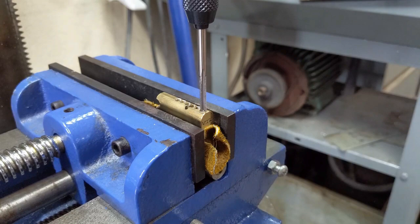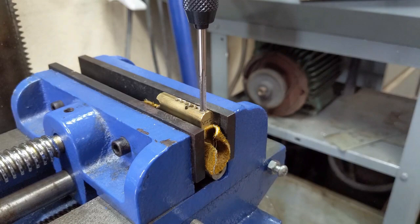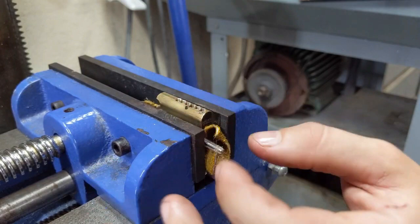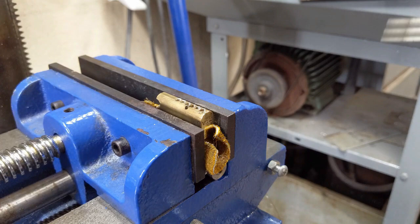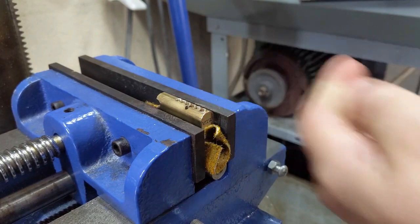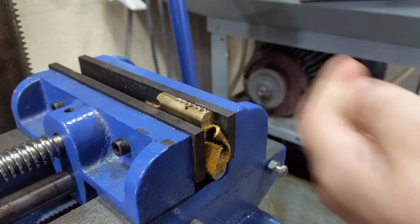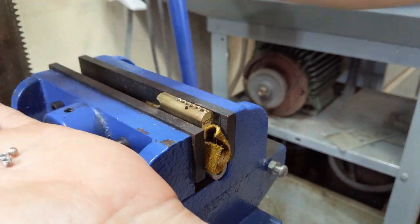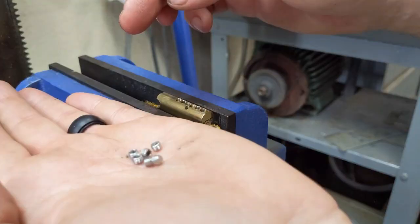Notice all that metal forming on my tap — I'm going to take some compressed air and blow it off. And we are done. Volume warning: I'm going to blow this out with my air compressor to remove any shavings and make sure there's nothing down in the core. What we're going to use for grub screws are these flat bottom M4, three millimeter long grub screws because it's what I have. A six millimeter grub screw would be more accurate.